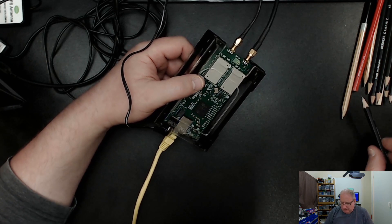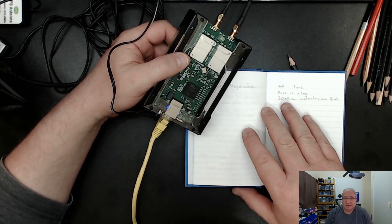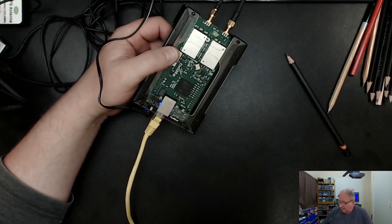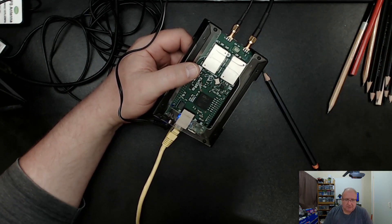It has 30 MHz of instantaneous bandwidth, which on the new version of the software is split up into configurable options. You can select how you want it: more receivers, more bandwidth, or wider audio bandwidth to listen to high-definition audio channels - though that restricts usable channels down to about three. The standard configuration is four shareable channels. These are really versatile and good fun.